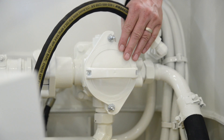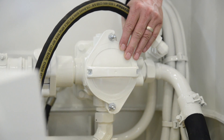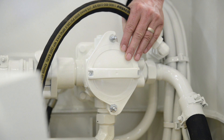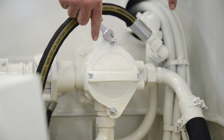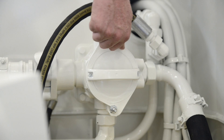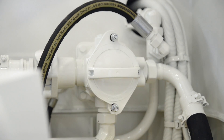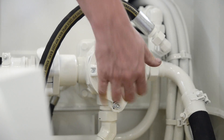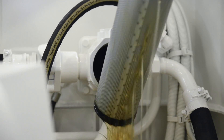The suction filter adds oil to the closed-loop circuit. It is a true suction filter that is in the tank, so there will be oil come out when we open it up. When I pull the filter out, there is a damper inside the tank that will close off the tank so that we don't drain the whole tank. To remove the suction filter, we loosen the nuts all the way to the end — you don't need to remove them. When I pull the filter straight back towards me it will close the damper, then I twist and remove the filter.